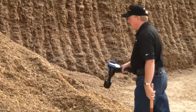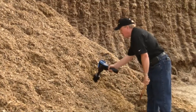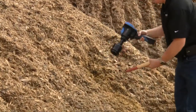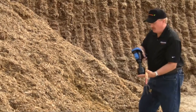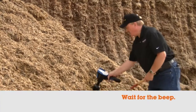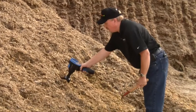I'm ready to start taking my scans. What I want to do is rake down to get to the moist feed. Place the device against the feed — I don't have to apply any pressure, just push it up against the feed so it's blocking out any external light from affecting the readings. Hold it against the feed, pull the trigger, you'll hear a beep and see the number advance on the screen, then lift it up and move to the next spot.